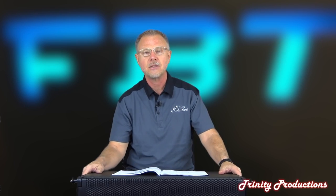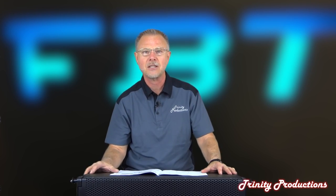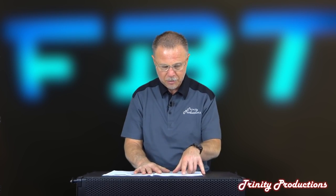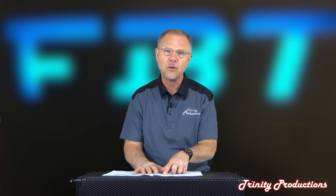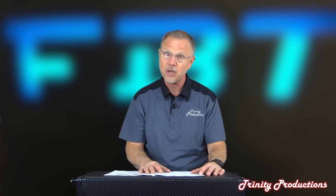First impressions: it is an all-wood box, about 85 to 90 pounds in weight - it is pretty beefy. The rigging hardware on it is fantastic. Going over the specs: it's a two-way configuration with built-in amplifier. We've got 400 watts going to the low frequency dual drivers, and then 200 watts going to the high frequency drivers. Frequency response is 55 to 20k.